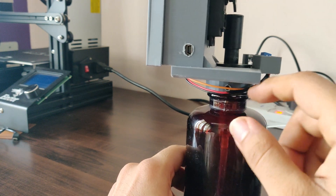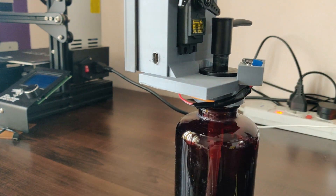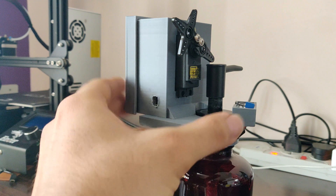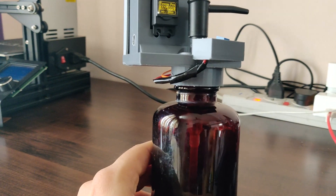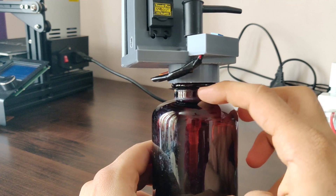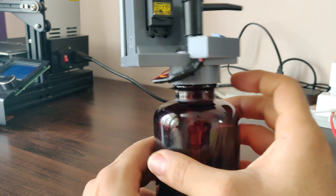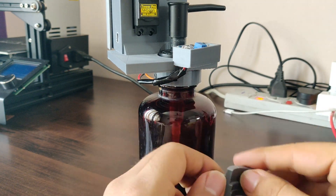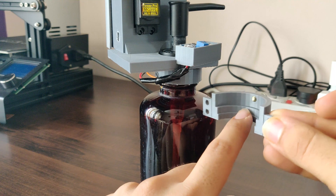There is a 2mm hole where you put the screw of the holder so that the top mount doesn't come out when the motor actuates. When the servo motor actuates and presses the dispenser, there is a tendency for the top mount to come up. So another clamping mechanism has been made so that you can clamp it to the base — it holds the base with the top mount. This is the clamp which will be mounted to the top mount and it will hold the dispenser below.